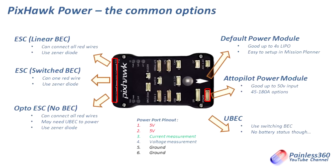Make sure you also install the Zener diode to avoid any nasty surprises. The last thing to consider is when you're using servos as part of the output. Servos can pull an awful lot of power, so if you're installing servos for things like gimbals or retractable landing gear, I would always recommend using a battery eliminator circuit that's big enough to power everything — looking at a BEC with maybe three or four amps. Don't rely on the BECs from the ESCs you have plugged in, as those are typically lower-rated, maybe two or three amps total. Large servos doing landing gear retracts can pull a lot of current, particularly if they're stalling or the linkages are a bit stiff.